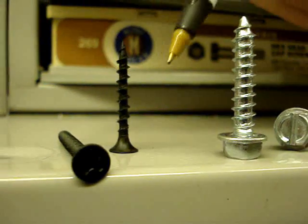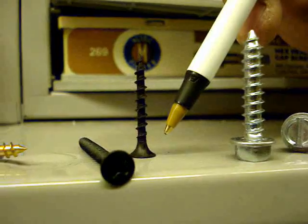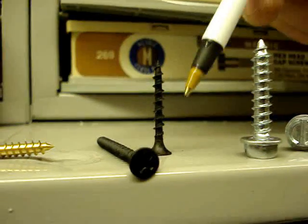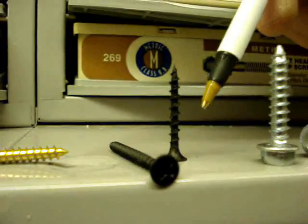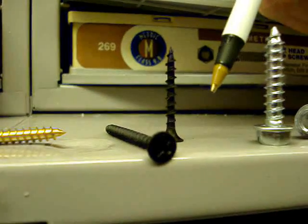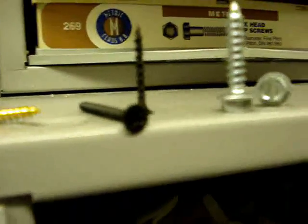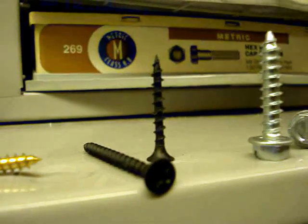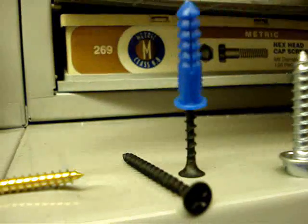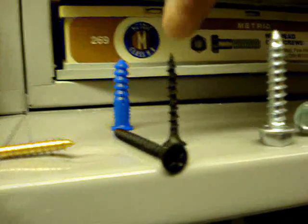A common mistake with this screw is calling it a drywall screw when people use it to hang things on drywall. This screw is not a fastener — it is made to go through drywall into wood to help hold the drywall to the stud. If you run it straight into drywall, it will only last days for holding anything; the threads will just rip the drywall and the screw will fall out. If you want to fasten something to drywall, put a conical anchor into the wall first, then insert the screw — it will expand the anchor and hold in the drywall. So a drywall screw needs an anchor.